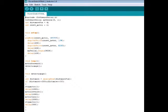So again, to summarize what this program is meant to do, it resets the motor controller, then begins the serial communication to the motor controller. It will then continually send signals to the motor controller, making the motors move forward, while receiving distance readings from the range sensor. Once the range sensor detects that the rover is getting close to an object, signals will then be sent to the motor controller telling it to stop, move in reverse, and then turn around. Once the rover has turned around, it will then once again start moving forward until it gets close to another object, where it will turn around again.